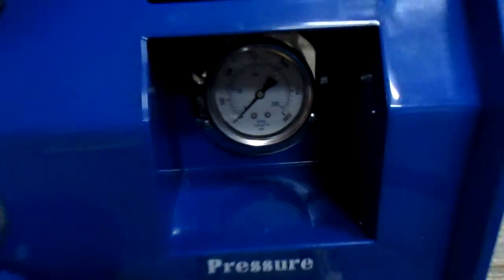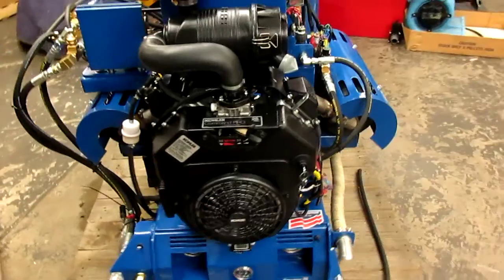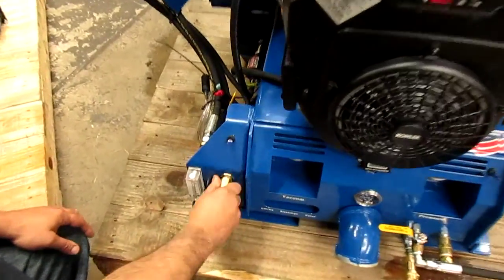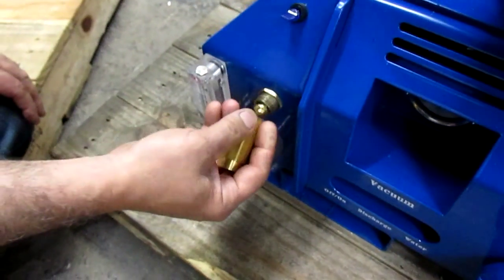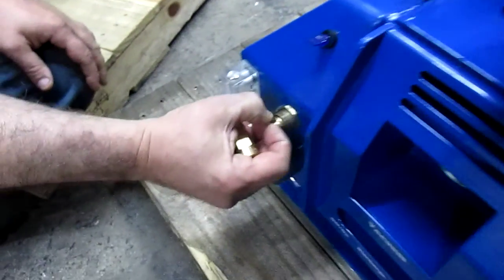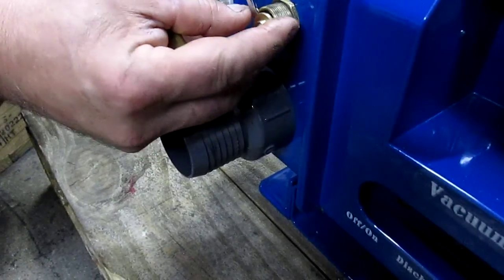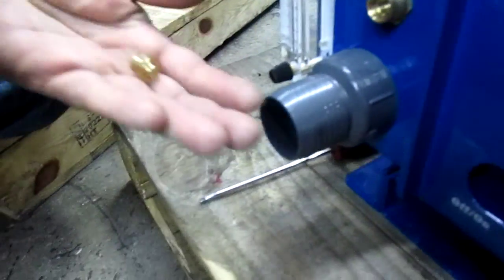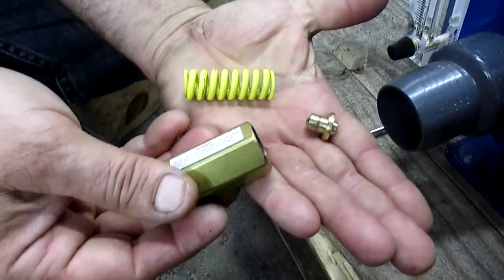One of the areas where you have no pressure or weak pressure is that sometimes your pressure regulator might come loose with vibration and come apart. There are three items that could be blown out of the regulator: a thrust plate, a spring, and the cap.